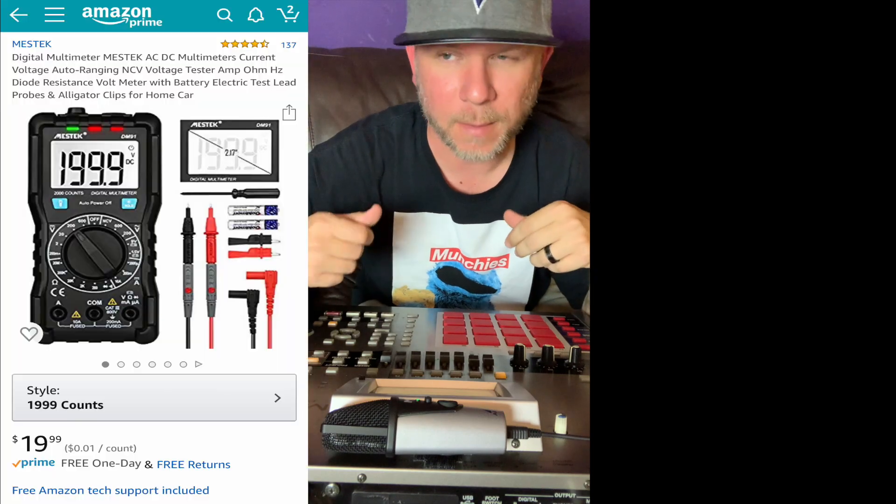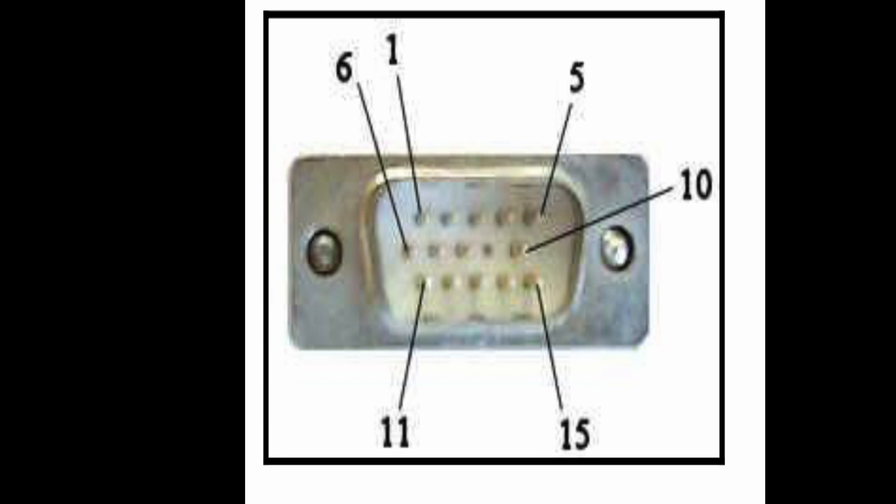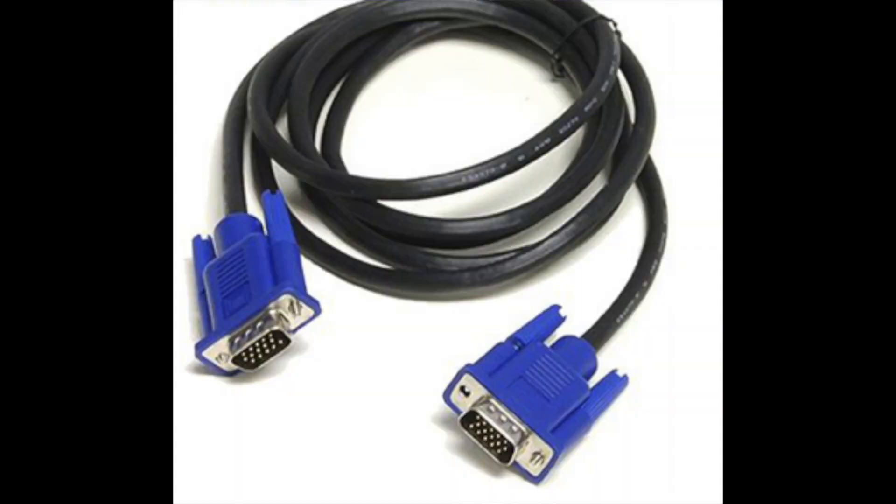Grab two of them, because one problem I had with one of the VGAs is I hooked it up, spliced it, and was testing everything with a digital multimeter — where you test the ohms. You touch the positive or negative side to the wire and then hit the prong inside the VGA; when it beeps at zero, that wire is connected to that pinout. My first VGA didn't have all the wires I needed, so I had to go back to Goodwill for another one. The blue one worked perfectly.